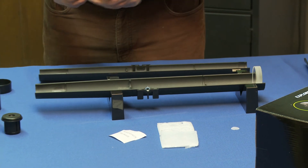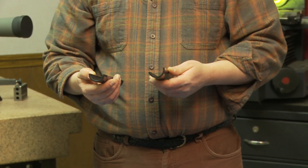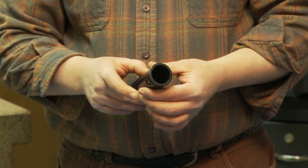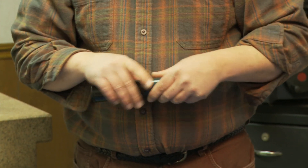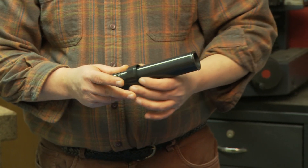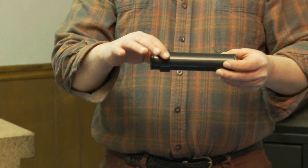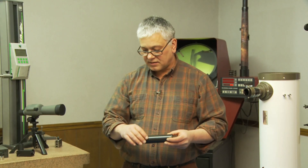Now what we're going to do is put together the focus tube. A lot of people do this different ways; this is how I'm going to do it for this demonstration. Basically it's tongue and groove, so it can't slide around — one tongue goes into the groove and vice versa. It's simply held together by two O-rings. I'm going to put this cover on next, and then put another O-ring on this end to complete the assembly. I've slid this on; you can always slide it on over the O-ring, but this makes it a little bit easier.